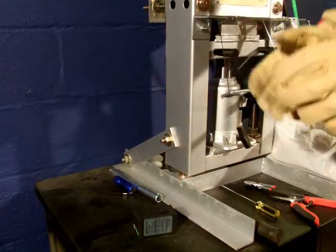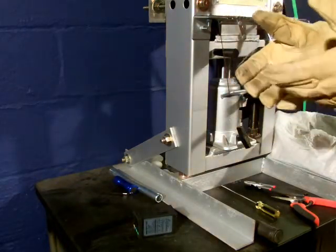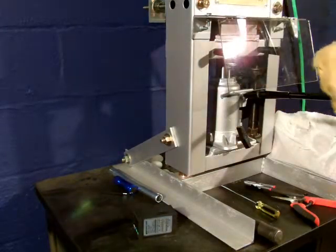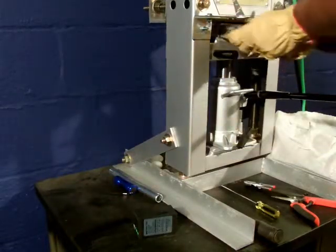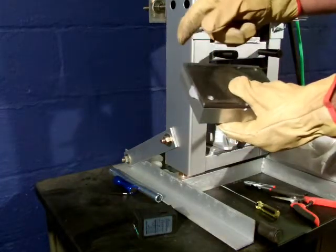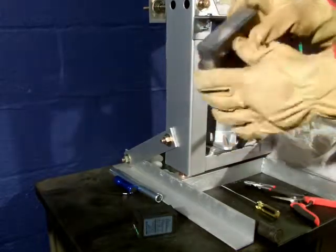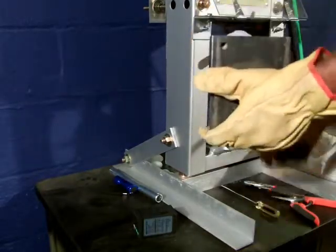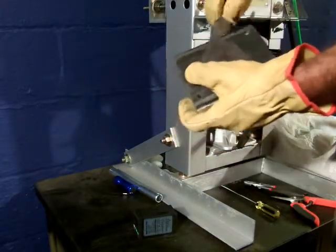The injection is over, and I actually on purpose overfilled the mold a little bit to show you what the flash is and how to deal with it. There is a flash, and the flash usually happens when the mold is overfilled forcefully against the injection pressure. But it's not a big deal, because most of the time the flash can simply be trimmed off or the pressure reduced.